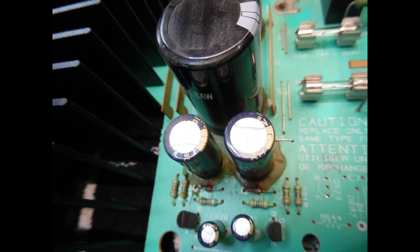The next thing I'm showing you is the low voltage power supply — this is the plus or minus 18-volt supply. During manufacture of this time period, for whatever reason they thought it was a good idea to put some additional glue around the electrolytic capacitors, thinking it would provide extra mechanical support. I've always scratched my head about this — I can't imagine there would be that much vibration which would result in excess stress on the capacitor legs or cause them to fall out, but here you have it.